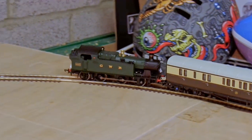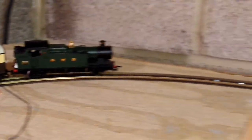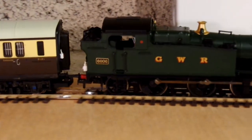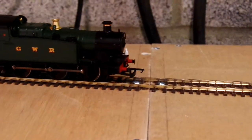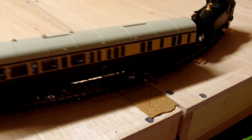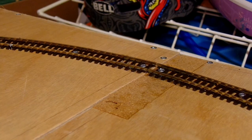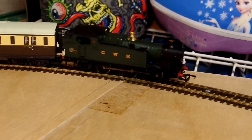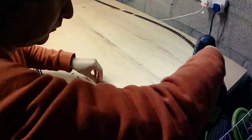In the opposite direction, it's not such a happy story. The first problem area I've uncovered is here at the join from the non-scenic Board 1 to the back of Board 2. For some reason the 5600 keeps losing its trailing wheels at that point. To the eye everything looks to be lining up fine, but clearly there's something misaligned there. Hopefully I'll just need to fine-tune the position of the ends of the track slightly. The more significant problem area is the curve at the other end of the layout. Bending the flexi-track to second radius wasn't easy, and although I secured the track firmly either side of the join, when I cut the track the ends sprang back out of shape. They just prefer to be straight. The result is that I've got a sharp kink just there, and my 5600 just doesn't like it. Now is the best time to fix this, before I go any further.